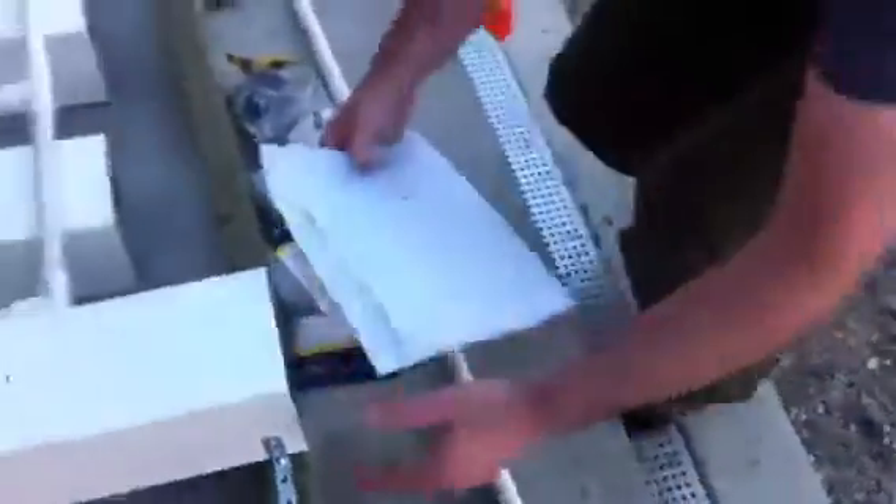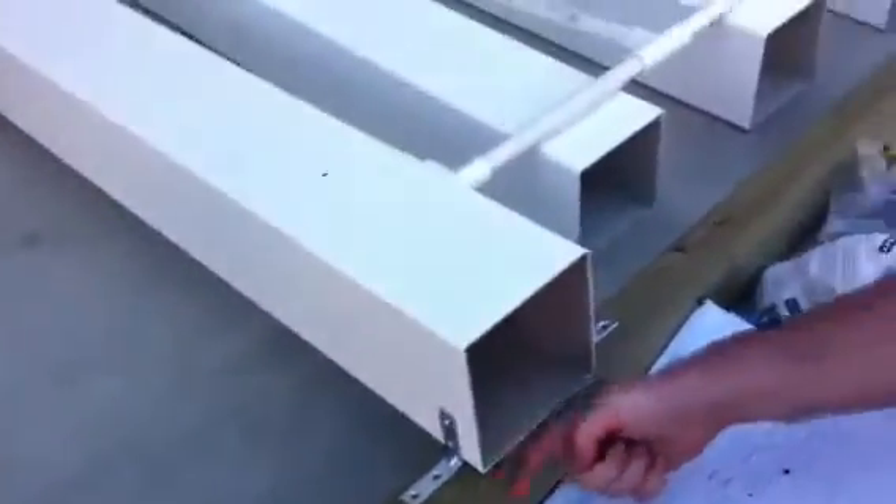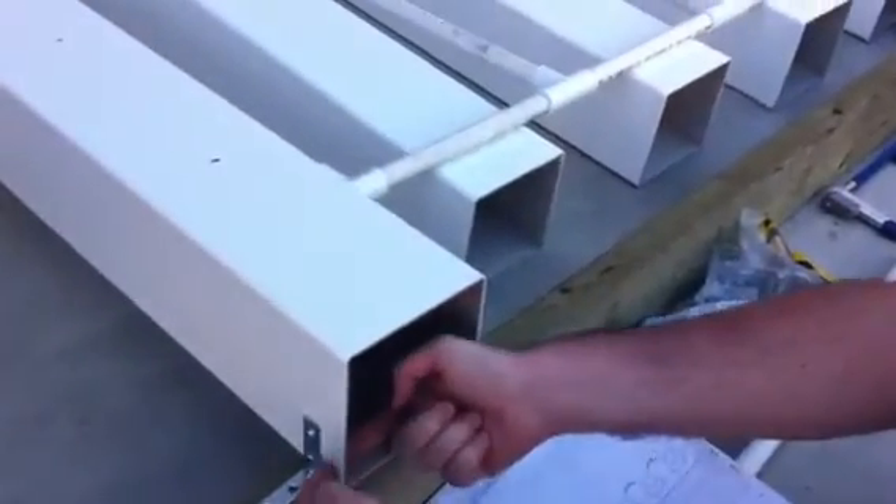For the notches, they aren't structurally very sound — you'd have to notch pretty far in and end up ruining the wood. If we go on top instead, that gives a lot more room to work with the pipes below. We can go through four times and bolt it from the side instead of screwing it. We'd also need a gasket or rubber washer, which is a lot easier. We have a few but will need to buy more at Home Depot, along with bolts — we do have a bunch of screws that are fine for that side.